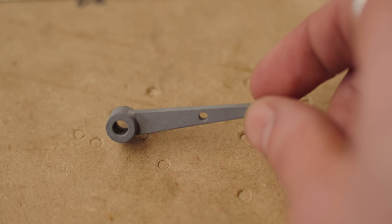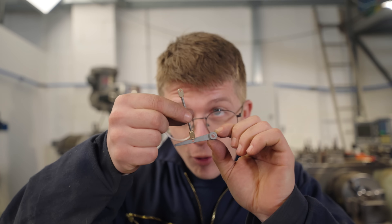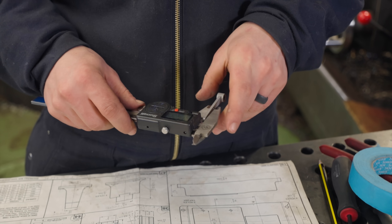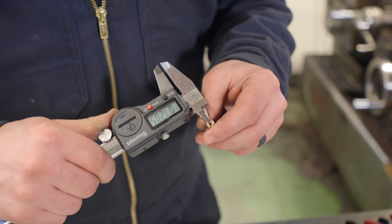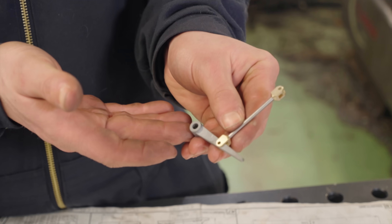This diddy little handle is meant to be connected by the little fork ends we made earlier. Unfortunately, something has happened with my mathematics — it doesn't fit. It's meant to be 125 thou — that's an eighth of an inch. How did I screw that up? It's come out at 120 thou.